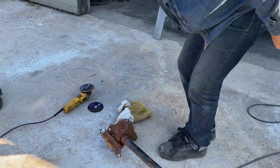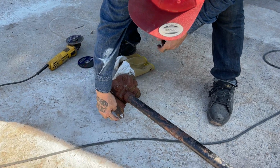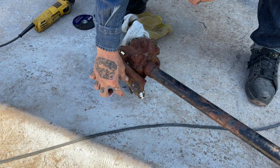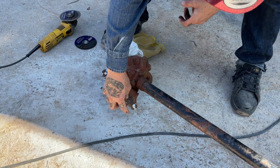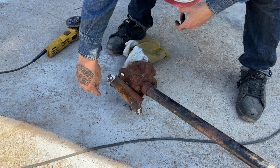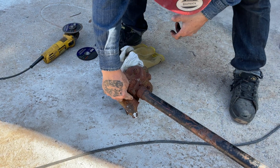I need the 4 by 5 inch piece. So what I'm gonna do is I'm gonna lap it on here. It touched here and it had a triangle coming here on the chassis. So I'm gonna weld it there. And then I'm gonna lay a piece right on top of the chassis, lap the chassis, over top of the chassis, onto this, all across here.